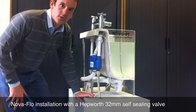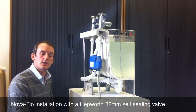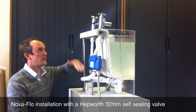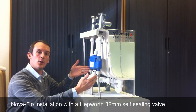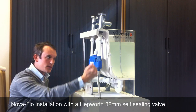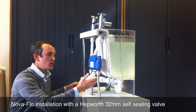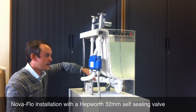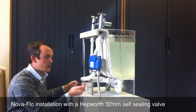This video illustrates how a Hepworth 32mm self-sealing waste valve can be used in the event of a particularly deep bath with an overflow fitting, or where the overflow has to be fitted in a lower position. A problem that can occur if the overflow is too low is water siphoning back when the bath is emptied, causing dirt to come back into the overflow unit. The Hepworth self-sealing valve prevents that from happening by preventing any water coming back from the trap.